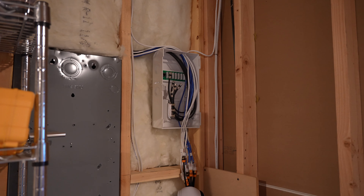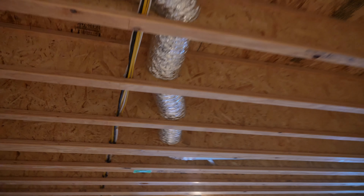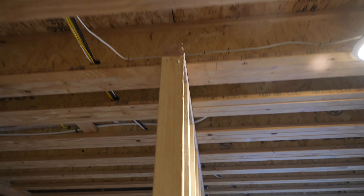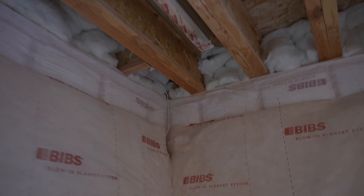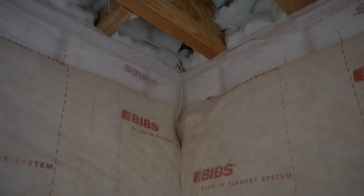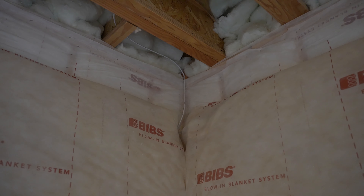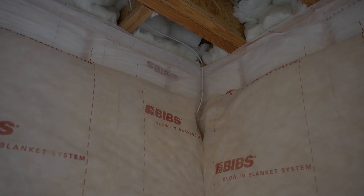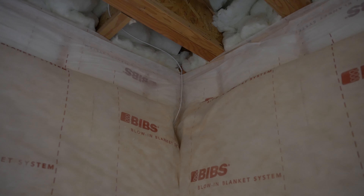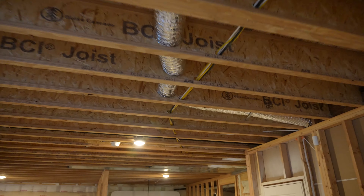Let's talk about the G4 Bullet on the side of my home and the G3 Flex. For the G4 Bullet, I just ran the cable through holes that were already in existence and then came out through the side of my home. It's much easier to go this route than climbing up into the attic, pulling down soffits and fascia, adding backing, and making sure it's all watertight and sealed. I bought some conduit pieces and it all worked out extremely well — a very clean install for that camera.